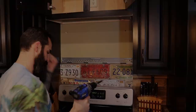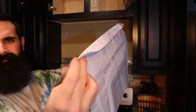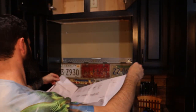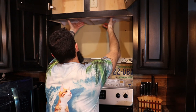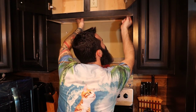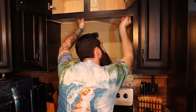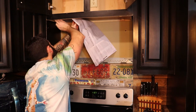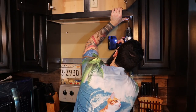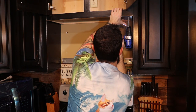If you've got a toggle bolt, go ahead and put your toggle bolt through the bracket first — I didn't do this because I had a brain fart, but it's a whole lot easier. Put your toggle bolt through your bracket, then put your bracket up there, slide your toggle bolt through the sheetrock, tighten it up, and then attach your other bolts that go through the studs. The microwave should also come with a top cabinet template. It's a little harder to deal with since you're working overhead — the template may come a bit big, so fold it to fit the opening. Your template should have three highlighted spots to drill out for your microwave bolts, and also one bigger spot to feed your cord through. Take your nail and push it into the center of these marked spots leaving a little indentation to know where to drill. Then take your three-eighths inch drill bit and drill out the three marks you made.